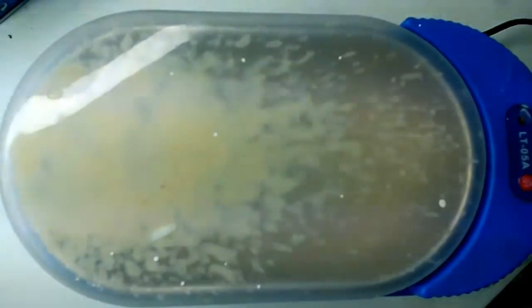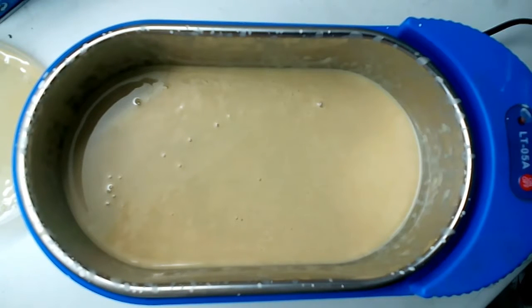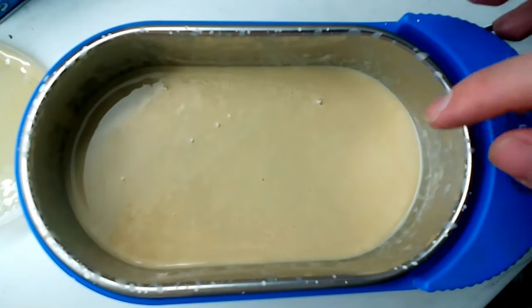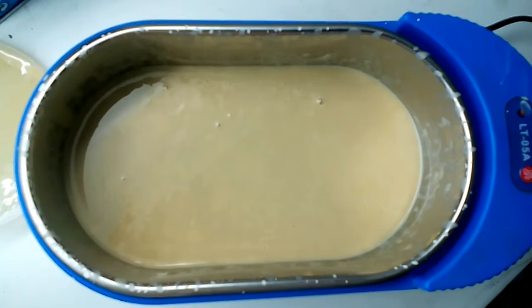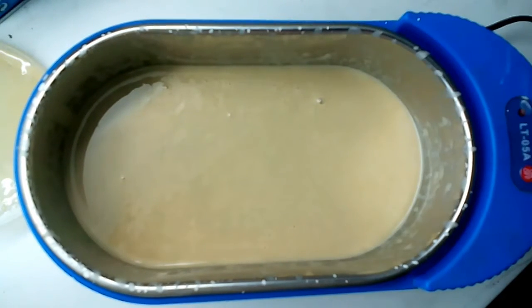After around 10 minutes have passed, let's see what's going on. You can see there is a little bit of steam over the ultrasonic cleaner. When you put this polishing gel in the ultrasonic cleaner, it gets a lot of energy from the ultrasound because there is too much friction between the compounds in the gel — it's not like water. Water flows very easily, but with this type of material it absorbs a lot of energy from the ultrasound. Let's see if it's not too hot to take out.